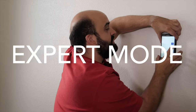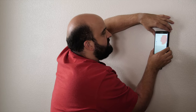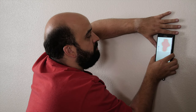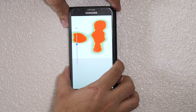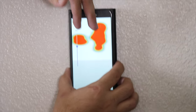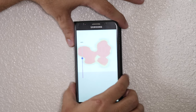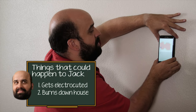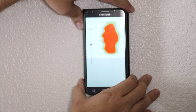The next mode is expert mode, and expert mode is my favorite. Now that I know that I have some things going on here, this actually gives me real-time data, sends it back into the phone, and gives me a pretty accurate image of what's behind the wall. These red areas are most likely my stud. And then as I go over, you can see two different anomalies come up behind the wall. I know this is most likely that electric line, so I want to stay away from this. I don't want to drill into it — I could electrocute myself, I could burn my house down. A stud detector isn't going to give you this kind of information.